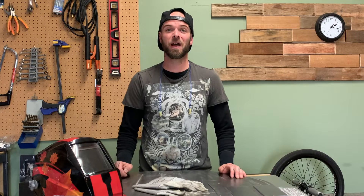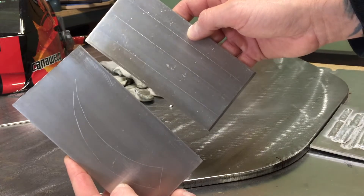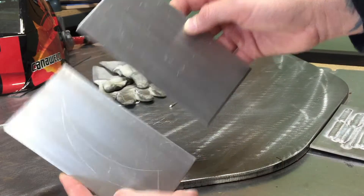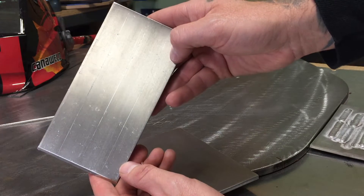So what do I practice? I practice these couple of exercises I'm gonna show you here right now. What you're probably thinking is I'm gonna be practicing super hard, difficult joints and overhead configurations — I do not practice that way. I keep it very very simple. All I do is trace lines and specific patterns on a couple of plates. I do these two exercises just to get warmed up. I have scribed two plates with two different types of welding patterns that I like to practice. The first one uses about three lanes or weld paths on a clean piece of aluminum.